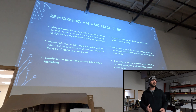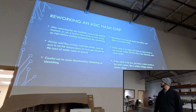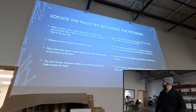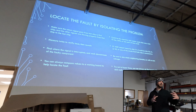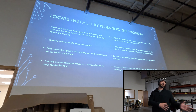We can also use flux — heat it up, remove the heat, add more flux, come back in. For diode resistance, the main reason we're working on that is if the value is off. If the value is too high, it usually means we have an open circuit. If it's too low, we have a short circuit. So ideally we're just trying to isolate the problem — following that signal, trying to see whether there's a break or something that's out of range. We're always making sure that the return signal is going from last chip to first chip, and that these other signals are going from first chip to last chip.